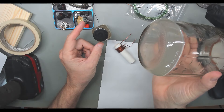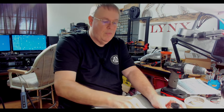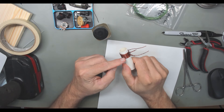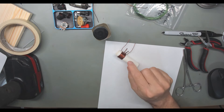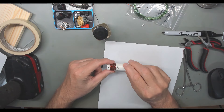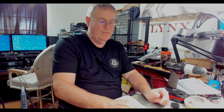We made this Q-dope in a mason jar — it's kind of thick, moves around slowly. You paint it on, the solvent evaporates quickly — I painted the first coat on and it was only a minute or two before I pulled the tape off. I'll go ahead and get the rest of the winding on this coil. I'm also thinking about adding another coil — one for the antenna of course, but possibly one for a frequency pickup. I may try to use the frequency meter we just played around with in the last couple of videos.